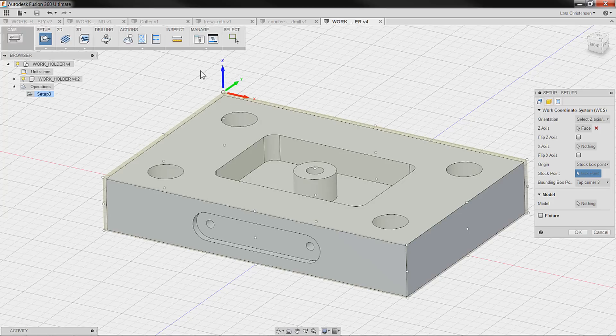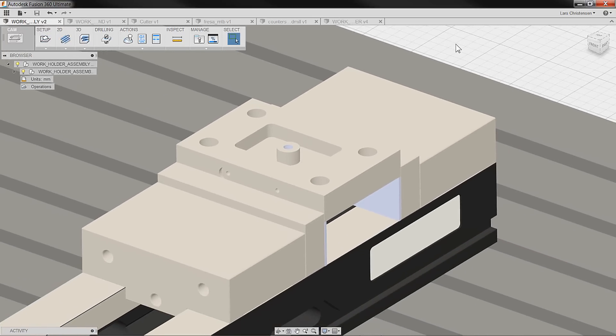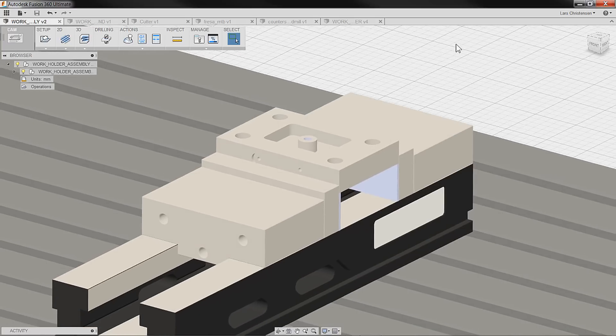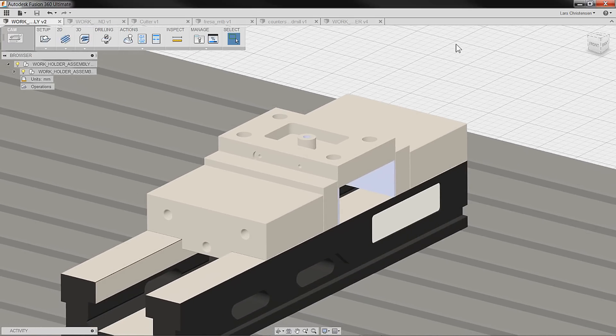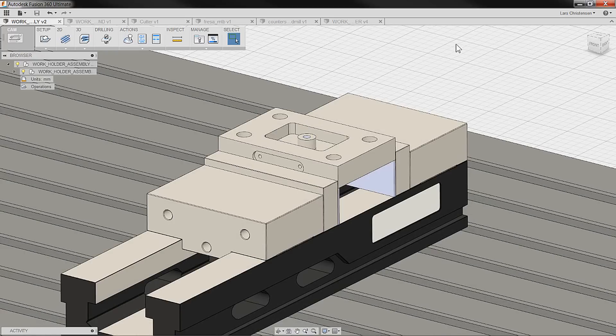I actually have another Fusion model where I've placed my model inside on a table in a vice — that's kind of neat. If you have the time to do this, I definitely recommend it, because you get a better reference representation of what's happening on the machine and you can get dimensions from it. But sometimes you don't have time for this, and we're going to program this part as if it was not yet in a vice. But it's a good way to show some of the things necessary to know: this jaw here is the movable jaw, and this is the solid jaw back here — it cannot move.